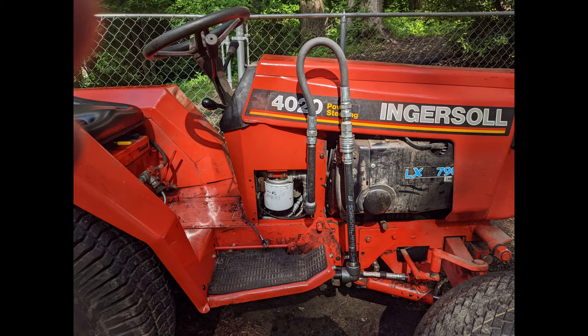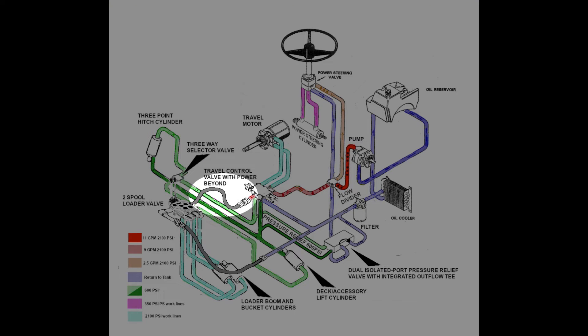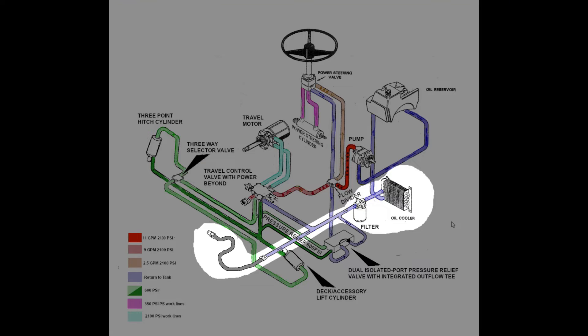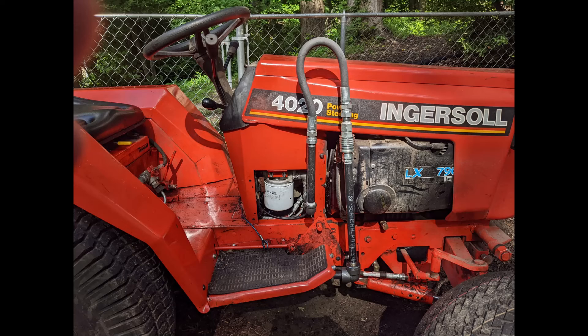In this photo, we see these two lines — the pressure feed line on the right and the return to tank line on the left — and they do look very similar, but don't be fooled. With the loader installed, the line on the right has to supply the pressure that drives the loader's cylinders and will routinely exceed 2000 psi. But the line on the left merely feeds into the oil filter, and it cannot, under any circumstances, experience more than about 50 psi. That's why standard low pressure fittings are fine for the return line on the left, but could never be considered for the pressure line on the right.